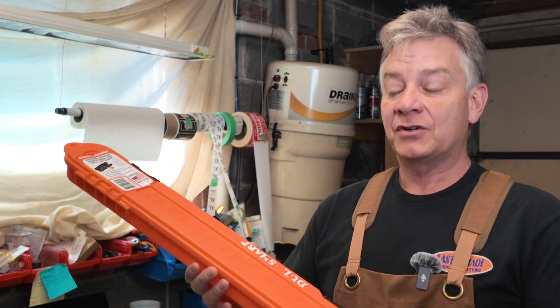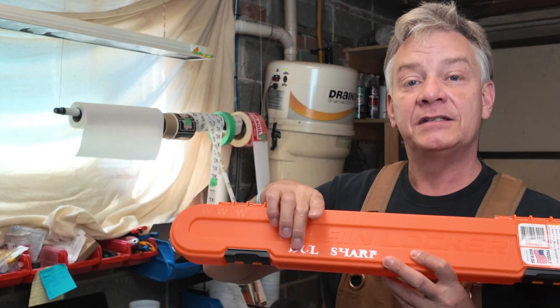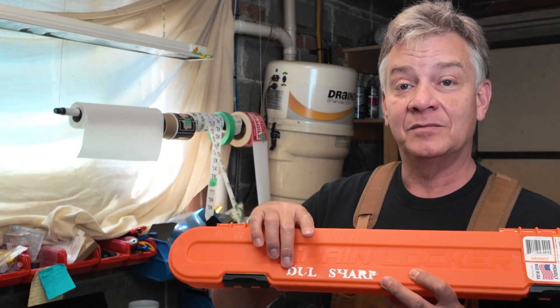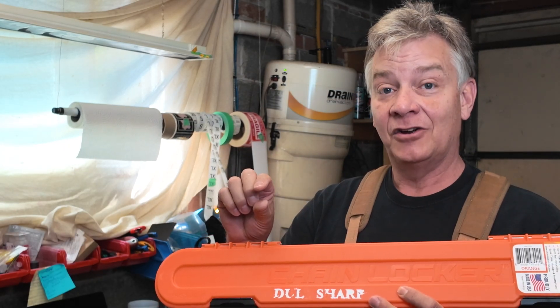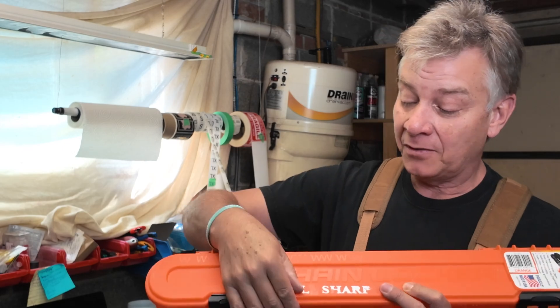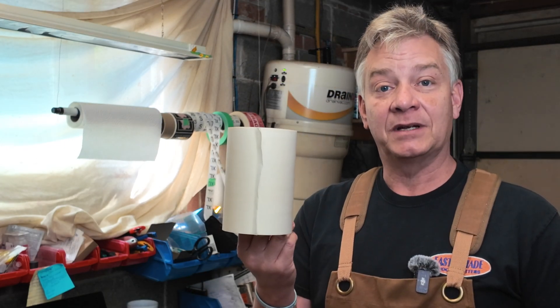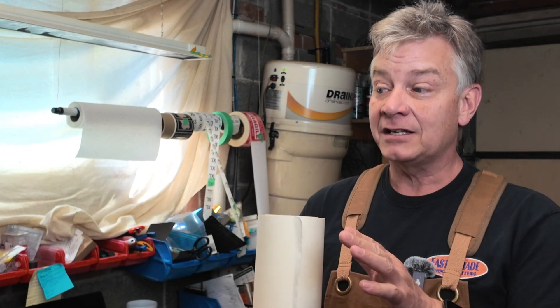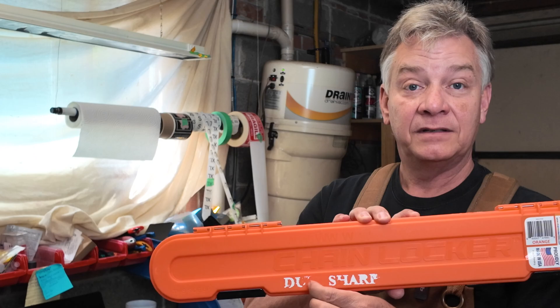Because the engraved is the same color, I'm trying to find a paint or a means to color those letters in permanently. Having a bit of a tough time finding the right type of paint to stick to plastic — the two I've tried so far say they stick to plastic but both come off pretty easily. The other challenge is that in order to paint those letters I need to mask them somehow, and this paper mask does not cleanly burn off under the engrave. It burns the paper but leaves all the glue, which gets mixed into the engraved letters and is very sticky afterwards. If you folks have any ideas I'd greatly appreciate it in the comments.